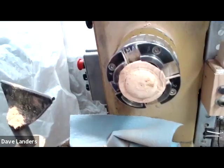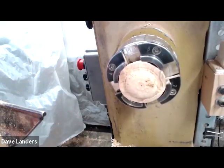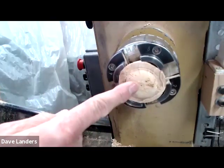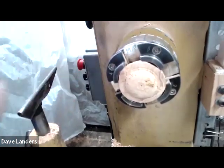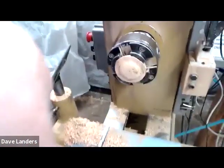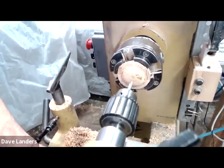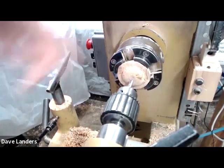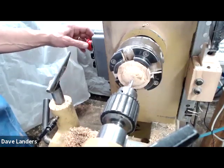If I put a brad point bit in there, the brad points on the end of those bits are about a 16th of an inch. If I make a 16th of an inch deep hole here with another 16th of an inch brad point going down, I'm probably going to run through the bottom of my piece. If I use a traditional drill bit, I'm going to have a little triangle-shaped hole, and it's not actually going to be what I want. So